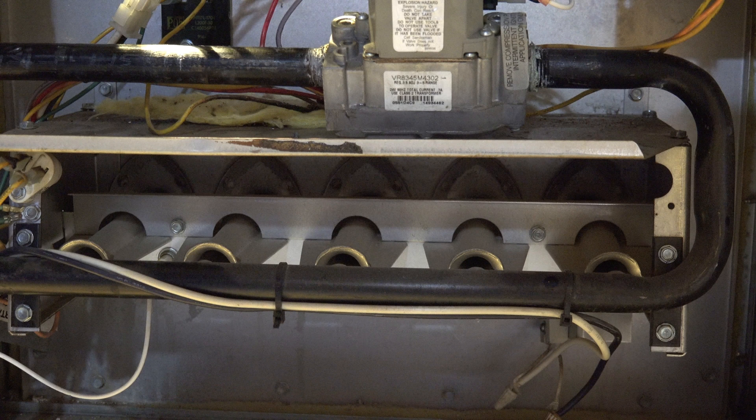The problem is it had a cracked heat exchanger which shut the furnace down every time the fan came on. Now let's take a look at this — if I actually change the way the venting was working, what would happen to this furnace if the venting back pressure was a little bit lower. Let's take a look at how this thing would work out.